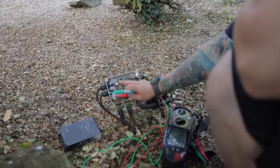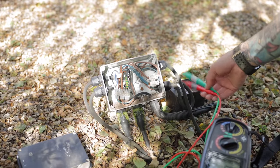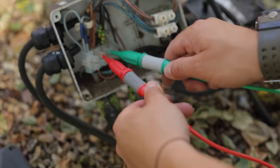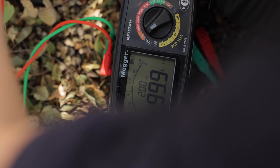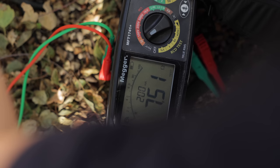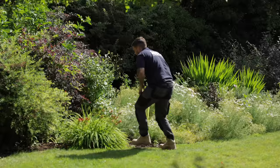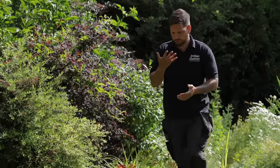That must be feed in, feed out, and then that feeds the transformer and goes out to the lights. I was getting a reading but it was fluctuating — 4.5, all over the place. Corroded terminals, full of soil. That's enough — it can just be remade and some gel put in it.